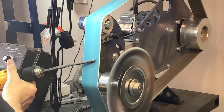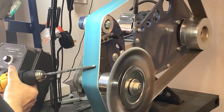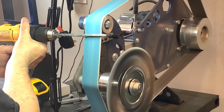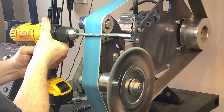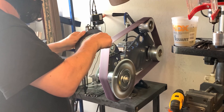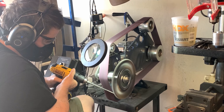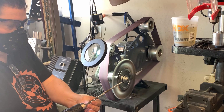Next step is to shape with a final taper. I do this on a used 36-grit belt. The trick here is to remove the sharp edges. Other more elaborate sticks out there have designs on the end, and we found that one of the reasons people like this particular style is there's no chance for it to snag or pull on hair. So after the taper, each stick is de-edged on the same belt prior to the final smoothing. The final smoothing is a more visual process — you can see I use the magnifier here. I switch to a finishing belt, take out the grinder marks, and run my finger over the edges to ensure nothing anywhere is sharp or able to catch hair. I also use the magnifier to get in close and see all the forging marks and hammer marks to make sure they're smooth and will take a final finish.